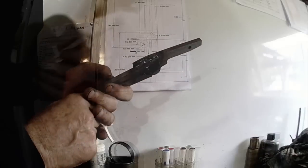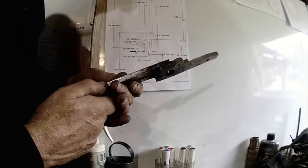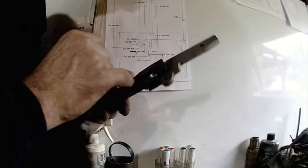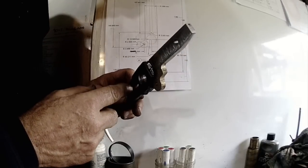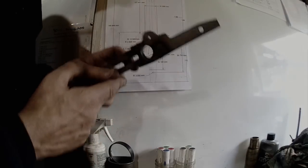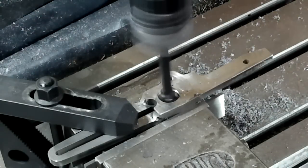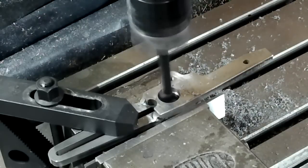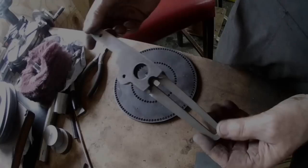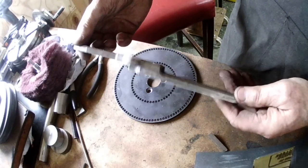After welding the two parts together, I cleaned up the messy bits, and I mounted the whole index arm in the milling machine to use the same boring bar to bore the hole through to 25mm, so that it slid onto the shaft because it needs to rotate and not grip. Like I say, I'm not proud of the welding, but it'll do its job.